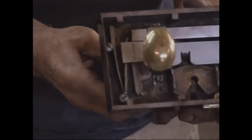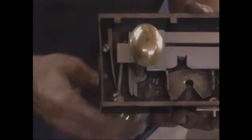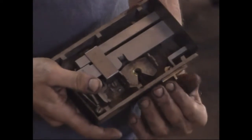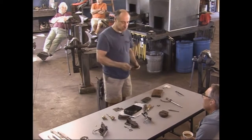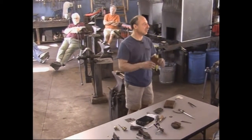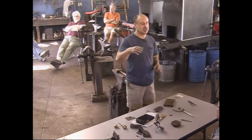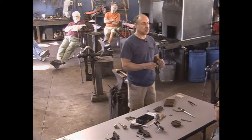So all the functions of this lock, let me turn this so the camera can see it. See that little cam there. All the functions of this lock can be done from both sides except for the privacy bolt, the slide bolt. So, to me, that tells you what kinds of use that the people wanted that door to have. We don't think about that much in the 20th century because almost anything you buy now has all the functions you want it to have. But originally you could buy different grades of locks that had some or all of the functions, depending on how much money you want to spend and what you're likely to do with that door.